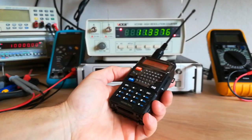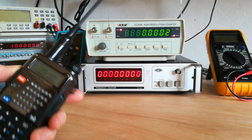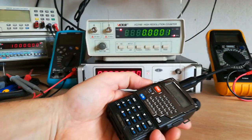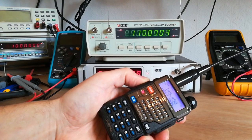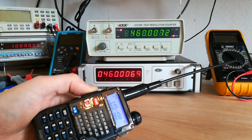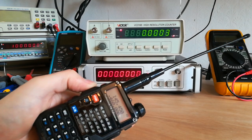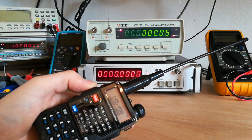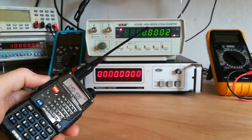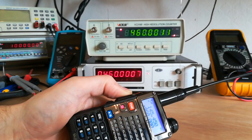The antenna is going to be quite large, or the antenna from the transmitter is going to be quite close. Whereas the top one, even though it's not built to the same spec, the antenna is going to be a lot shorter and it's much more sensitive. So if I key up, we're on 460. See the display — just alter the handy to 460 exactly. They're both doing a reasonable job. The top one is quite slow compared to the bottom one; the bottom one is almost instant, whereas the top one dances around a bit first.